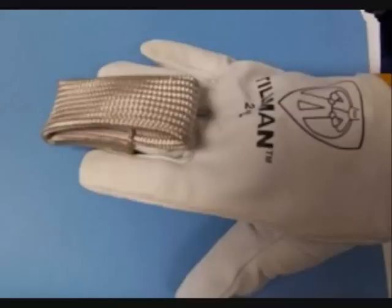You don't really have to do the pull-back motion — you can just go straight forward and pause. But I find it helps to lengthen the arc just a little bit when you add rod, and you sharpen a whole lot fewer electrodes that way. Another approach is using a slightly bigger rod for the butt joint and just laying the rod in there. It's a lot less motion and tends to look pretty nice, but you're never quite sure if you're penetrating because you can't see the puddle going into the root of the joint.